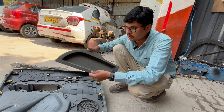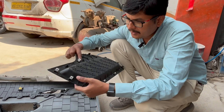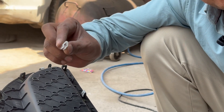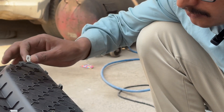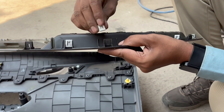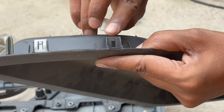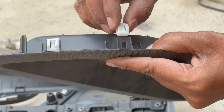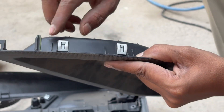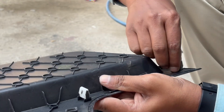One more component is this storage bin. The back side of the storage bin has a clip tower, and over this clip tower there is a clip. This can be a plastic clip, or the same clip can also be made of metal. You press this clip over the clip tower — you take the clip, center it on the rib of the clip tower, insert it, and once you push it, it locks with the cutout that is there.